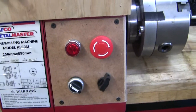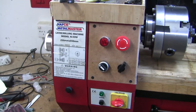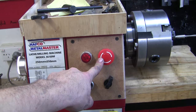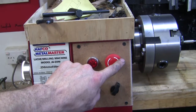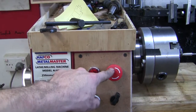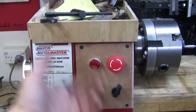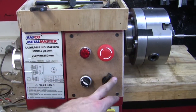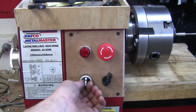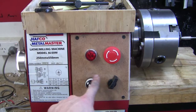There's my new control panel, which I haven't labelled yet. The e-stop is the main motor control — it disconnects the motor from the speed control and also activates the speed control shutdown. It doesn't actually cut power to the speed control, it just tells it to shut the motor down. This here is our speed control, and the main power is a three-way switch: left on, middle off, right on two different poles.